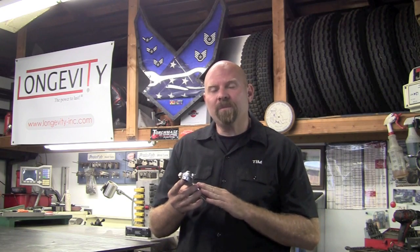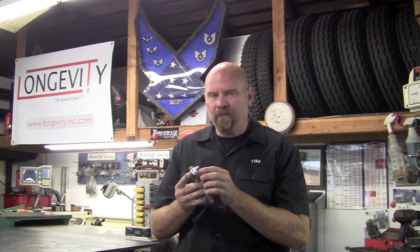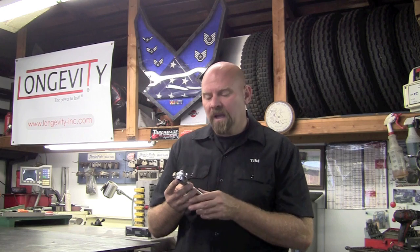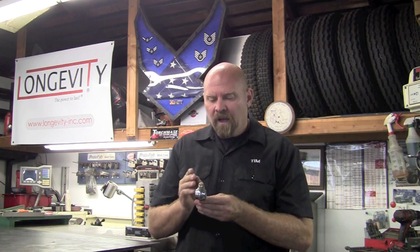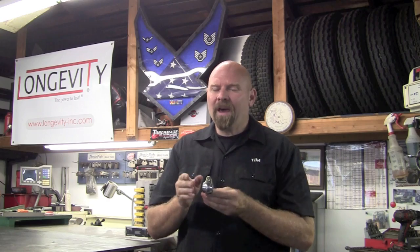Part of being a fabricator and a welder is being able to create something that doesn't exist stock. Here we have a 1939 gooseneck that had a very long reach on it, and a client wants this shortened up so he could actually reach the bars. This is a good opportunity to show you about tacking a piece up to keep it from twisting, and about how heat tends to pull things to one side or another, and how to try to counteract that.